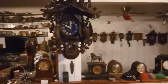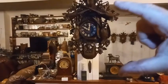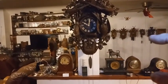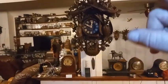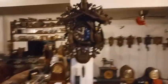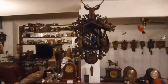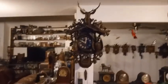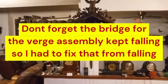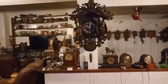I broke that wire so I had to make another one. Then the 90-degree wire — the wire that pushes on it to start the cuckoo in motion — I broke that wire too and had to make another one. I also had to adjust that 90-degree wire from the wire that has a tail on it; it has to be adjusted just right in order for this clock to work properly.